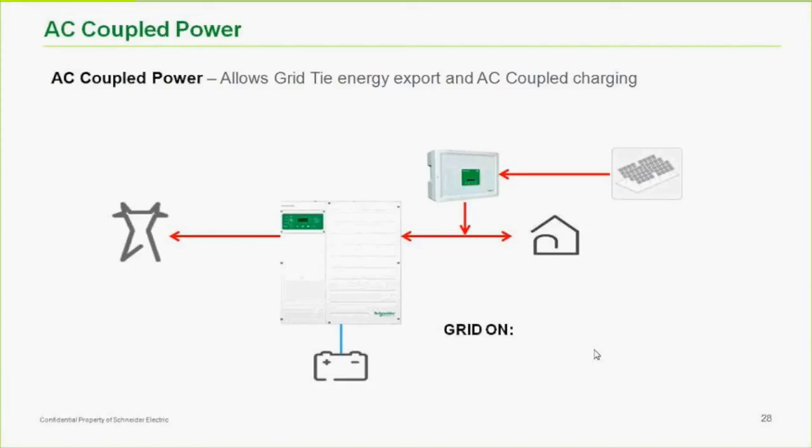So even in these large systems where AC coupling is very useful, because you can have the array on grid-tie inverters throughout the village, for instance, or up on the hill or wherever, far away, I do like seeing DC coupled solar on anything close by, because that gives you direct access into the batteries. So in an AC coupled system, by design, the XW sets up three-stage charging for the inverter source. It won't, well, not really. Three-stage charging means that the inverter has regulation capability. It has the ability to control an algorithm.